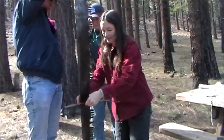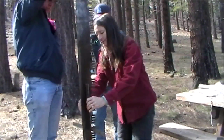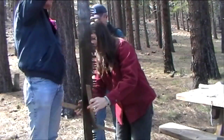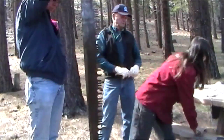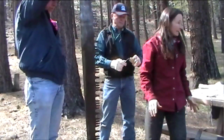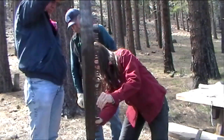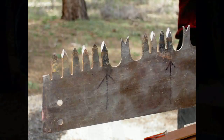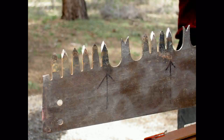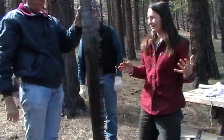I evaluate it like this to see if the saw is cupped — no. But once I find a spot like this I'll make a finger mark or get a sharpie pen and try to mark that exactly at the angle it looked like it was. Some saws I deal with have all marked up by the time I've gone down them with the straight edges, because some people just don't take good care of their saws.